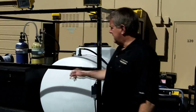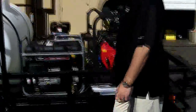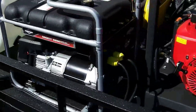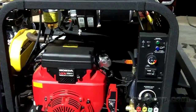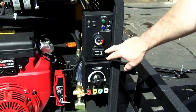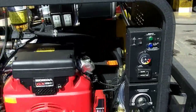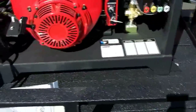Now that we're on this side, we've got a picture of the generator — it's a pretty straightforward 5,500 watt generator. Here's a side view of the Landa control panel. You'll notice things like a fuel water separator, four nozzles, upstream detergent which we don't normally use, a tachometer, hour meter, adjustable thermostat, burner on/off light, and low fuel. English, Spanish, and French labeling — all JIC fittings.